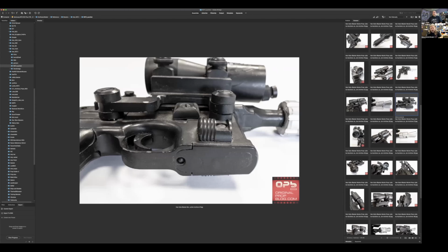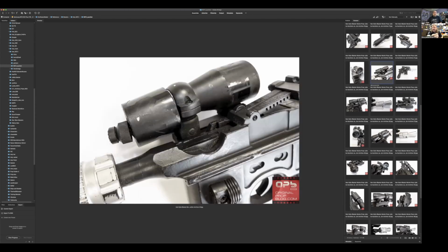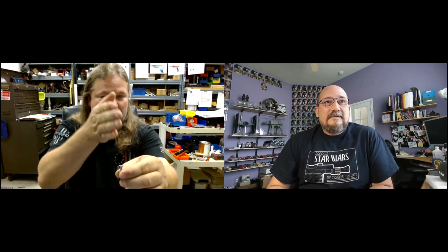And I made that little piece. But let me get it in the view here if that'll show up. Let me bring back our regular screen and stop sharing so we can, there we go. Yeah, that little piece there. Get it to focus on it. I thought it was a reflector too. That's what everybody thought it was, until we finally saw one up close and we're like, hey, that's a screw. Yes, it's actually a flathead 10-32, and I guess they took a file and went back and forth, and I mimicked it pretty closely. I did it with CNC, with an engraving tool, back and forth.